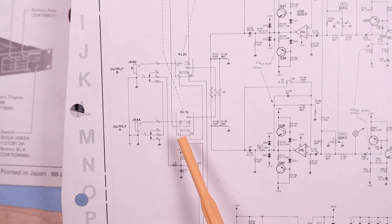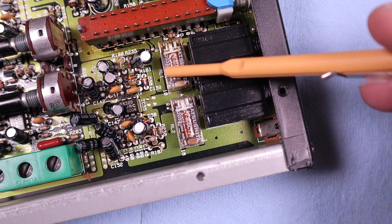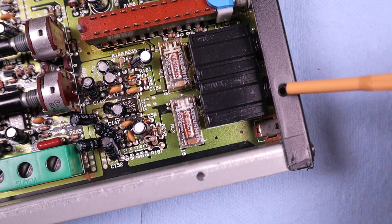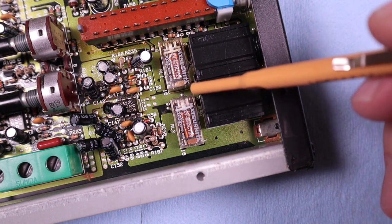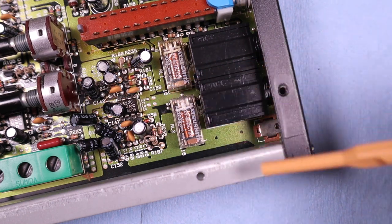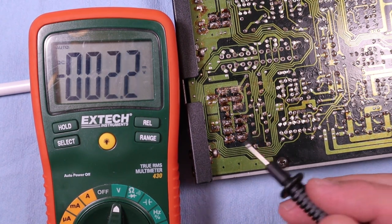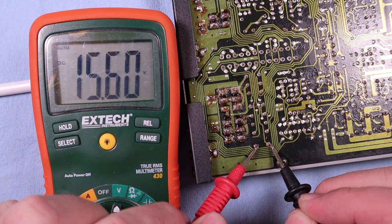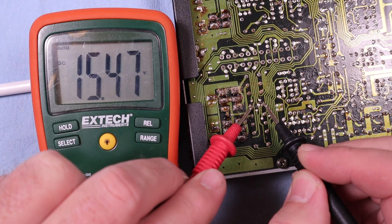The positive does come in on pin 1, so let's look at the unit and just measure it — see if we get our 15 volts there. You can see relay one and relay two, and pin 1 is near the back of the chassis where the connectors are, with pin 16 opposite. Flipping it over, if we get on pin 1 we've got 15 volts there for relay one, and relay two is also 15 volts.